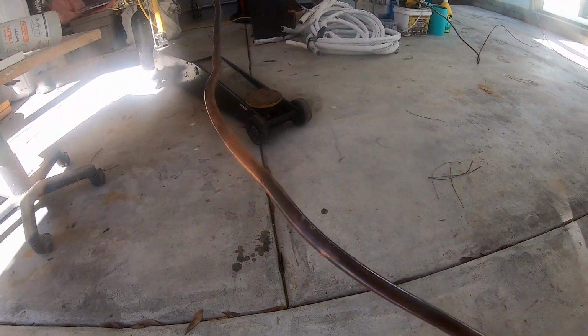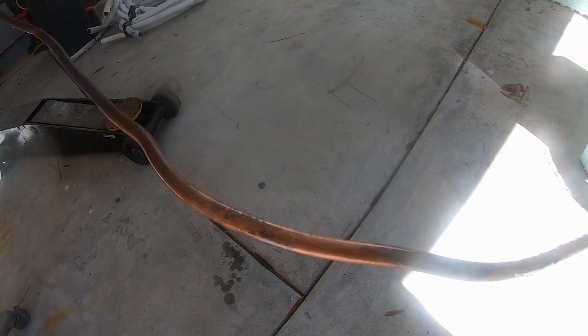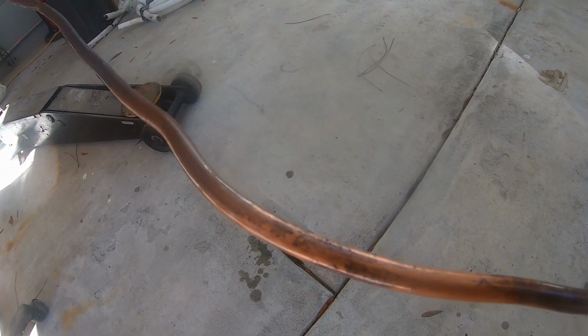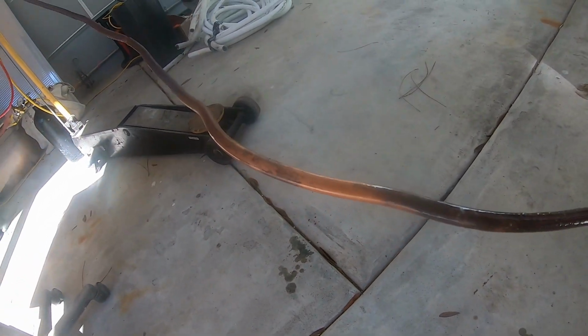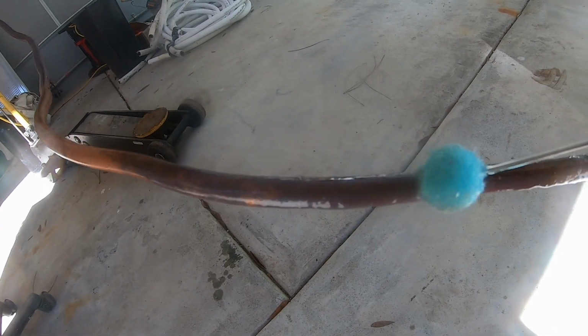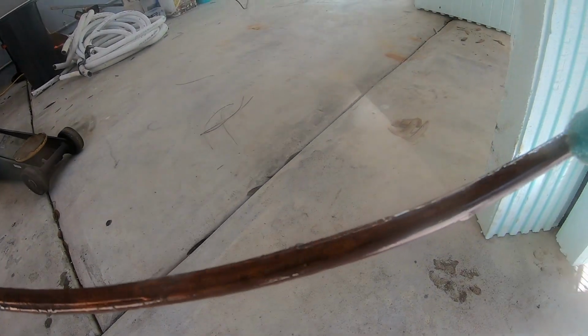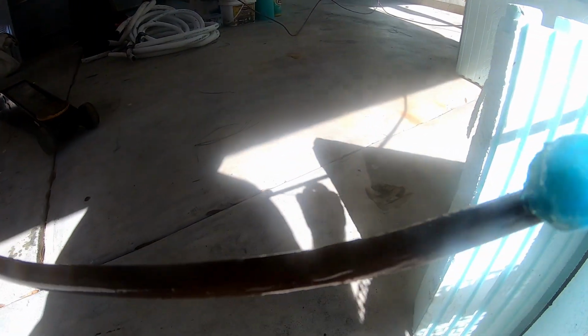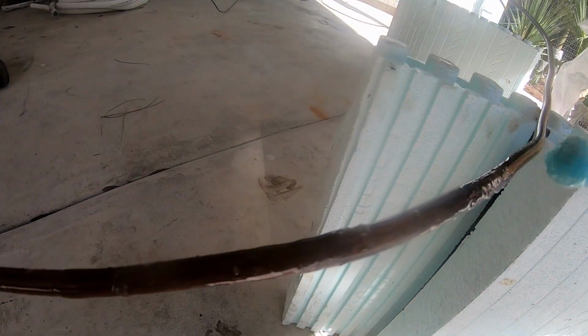And this was all up inside my sleeve. From that clean spot right there was where I had some elastomeric tape. There was a break in the white stuff, and I filled that joint. I wrapped some elastomeric insulation tape and then put the LS 300 or 700 UV tape over that. You can see where that elastomeric was. The copper's fine. It looks like it should look. As soon as the white insulation tape started, you go right to this, and it's leaking everywhere. It's not even just a leak, it's all leaks. And it's not just this one spot.